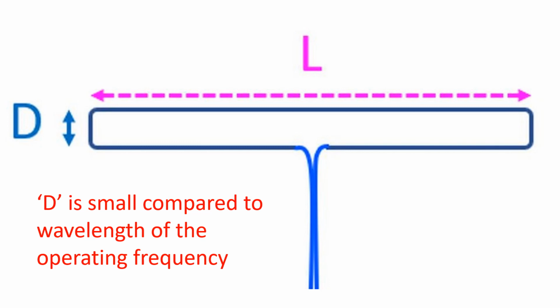Half-wave folded dipole is commonly used as the driven element of a Yagi multi-element antenna. Like a half-wave dipole antenna, the folded dipole is also resonant and radiates well at odd integer multiples of half wavelengths. As mentioned in case of half-wave dipole antenna, it acts as a 3/2 wavelength dipole at 3 times the fundamental frequency. Folded half-wave dipole antenna is preferred when the impedance has to be higher.